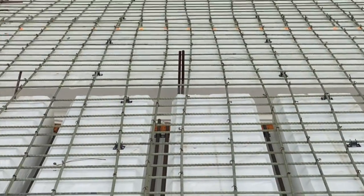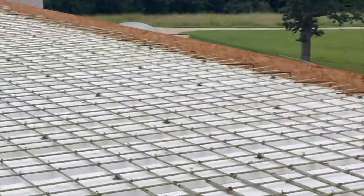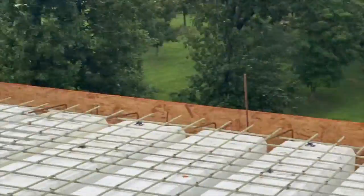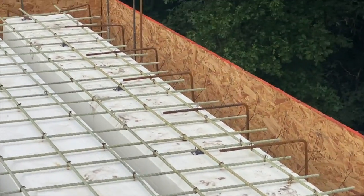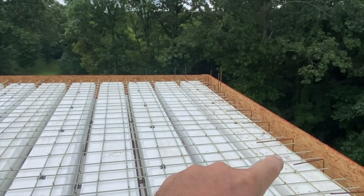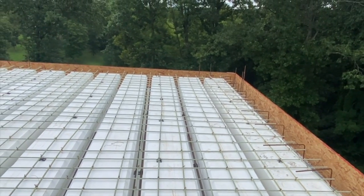Number 6, 3/4 steel rebar in the bottom, sitting on these chairs in the bottom of each beam. You'll see me during the pour. I think my job is basically gonna be vibration. The plan is we're gonna have all the boys here. I'll have to be keeping them out of the camera angle, obviously. But we're gonna pour this in like 6-ish, 9-ish sections where I'm going basically 22 to 25 by 25 in the corner here. I'll get into my mix design day of, but I'm using Xypex as a belt and suspenders thing.